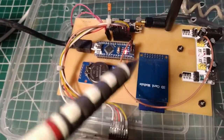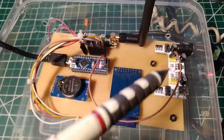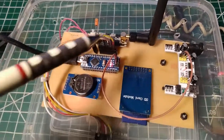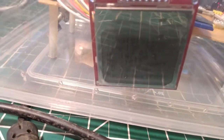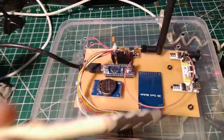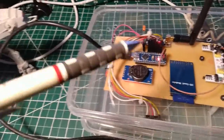There's a 12-volt power supply that converts 12V into Arduino-friendly 5V and 3.3V supplies. There's also an LCD display which acts as a status indicator — confirming the unit is working correctly and the radio link is active.